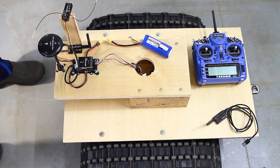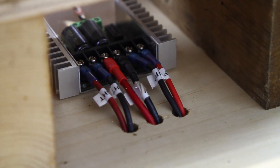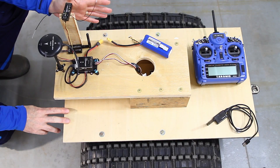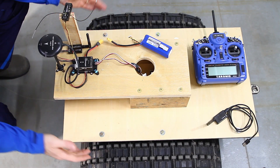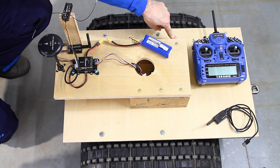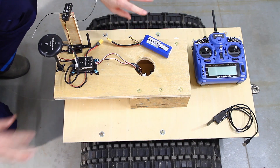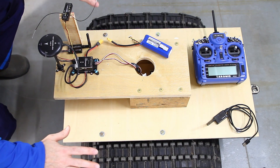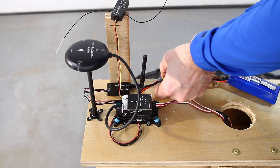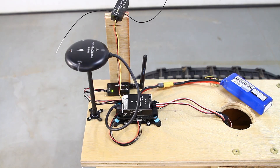Let's take a look at the way that this is connected. There are two battery systems in this — two 12-volt lead-acid batteries connected in series to make 24 volts that runs the motors. There's a dead cut-off switch to the motors, so if something happens I can slap that button and the motors are disconnected.